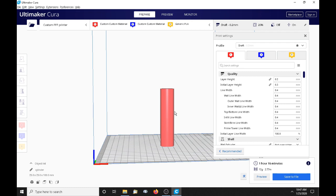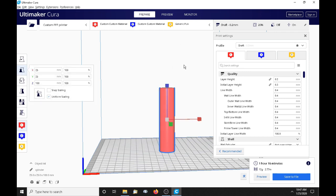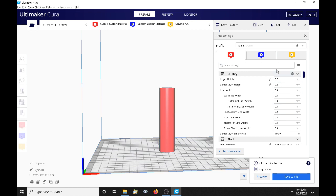It's a handy tool to have. I posted it already set with the gradient command on one of the Facebook pages, but this shows you how to do it yourself. When we slice for a gradient, we just use E0 as the default extruder as if it's going to be a single-color print. One thing we need to know, no matter what print you have, is how tall it is — this cylinder is 100 millimeters tall, and we need that for our M166 command.